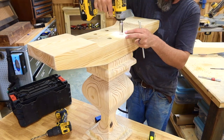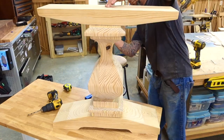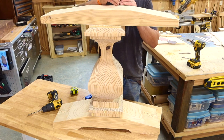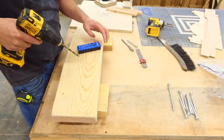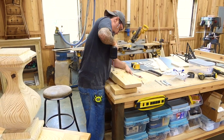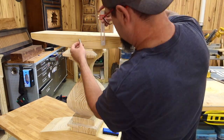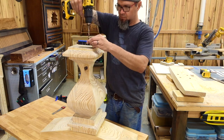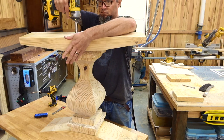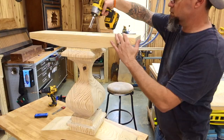To put on the top board, do the exact same process. We will not be gluing this in case the customer wants to take it apart. To attach the top, use four inch lag screws. A tip: add two screws in first just to find your pre-drilled holes — that way you make sure your bolts are lined up perfectly with the holes already in your base.